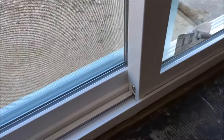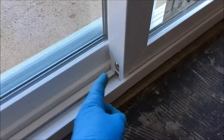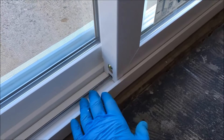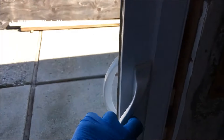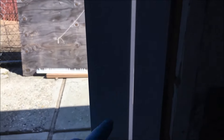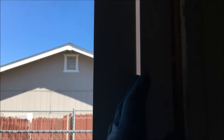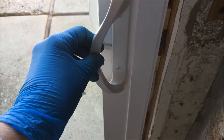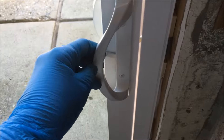Some of the problems where you would want to adjust the sliding glass door roller assemblies: first, if you have a gap — open your sliding glass door and check that reveal or space. If the gap is larger at the top of the door than at the bottom, you know it's time to adjust the roller assembly.